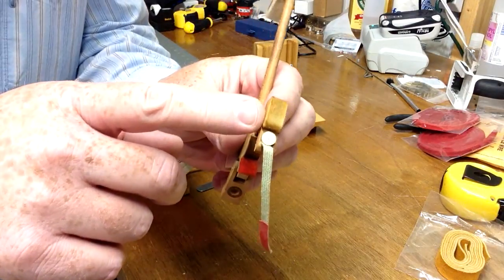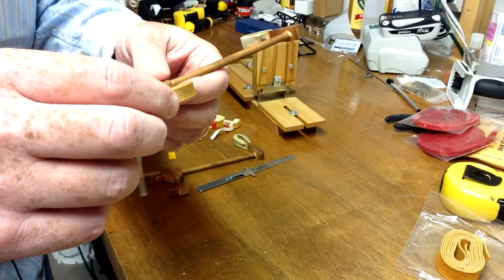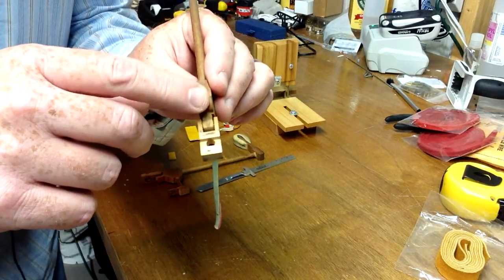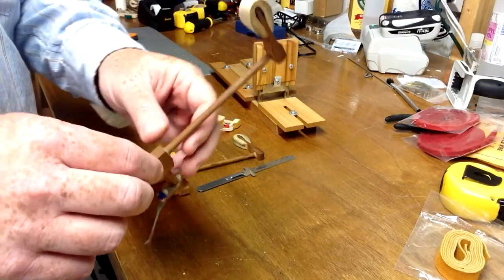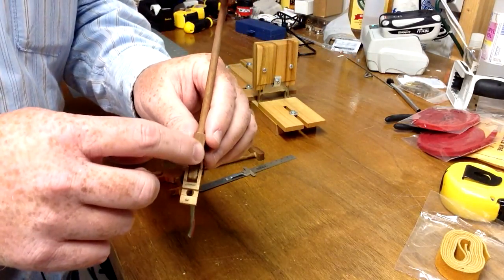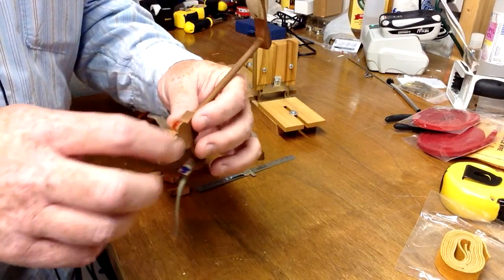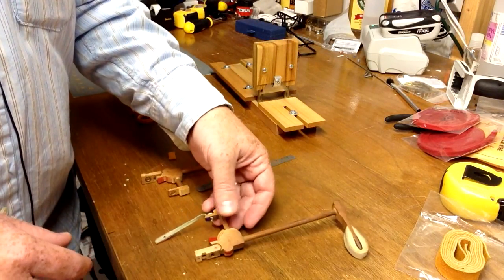So that's the catcher leather — there's a little piece of leather there and that gets worn as the piano gets played, as well as the spring felt. That's the slot here for the hammer butt spring. Not all pianos have felt in this slot, but many do, and so it's good to replace that as it gets dirty and hard and needs replacing from time to time.